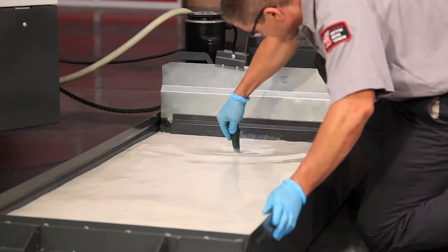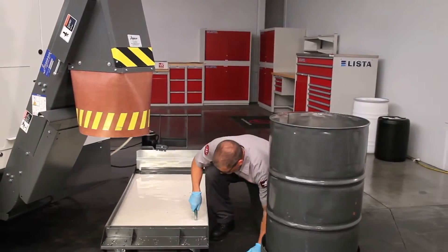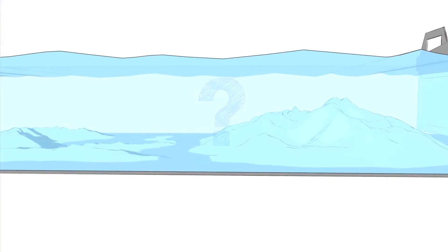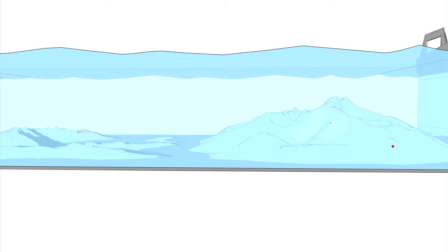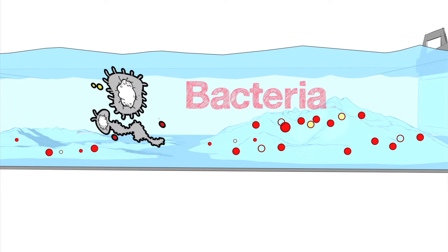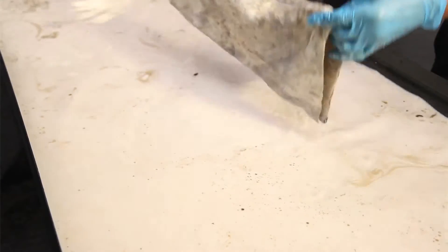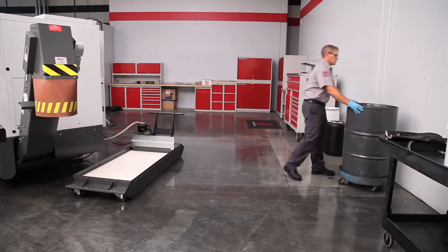Check for chips in the tank using a perforated scoop. Drag them against one wall of the tank and scoop them out. There are a couple of reasons why it's a bad idea to let chips pile up in your tank. When you're topping up your coolant, how will you know how much room is in there? Those chip piles can take up a lot of tank space — enough to make a real difference. They also provide the perfect environment for oil-hungry bacteria to grow. We've cleaned the coolant surface and removed the chips — this tank is ready for top-up.